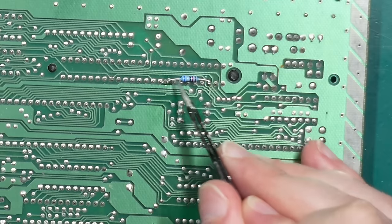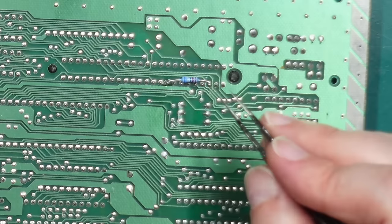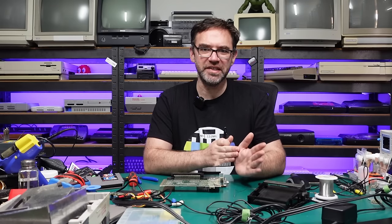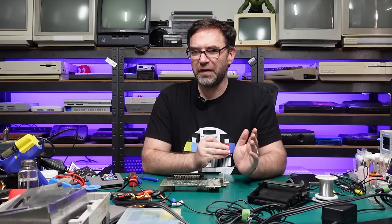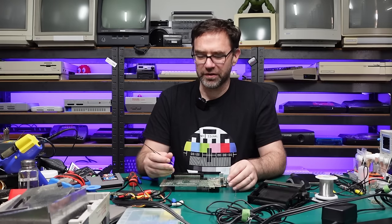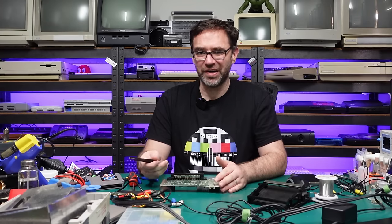I've just tacked that in quick and dirty — as long as those legs aren't touching the pins in between you'll be fine. There's one more recommendation I've seen: put a resistor between pin 3 and ground to get rid of any potential noise from the expansion audio mod. I tried a couple of different resistor values and found that the difference in noise level is about 2 dB, but when you're talking about minus 60 dB and minus 58 dB there's not much of a difference, so I'm going to leave that resistor out. If you choose to put one in, I found best results with a 3.9k resistor — some guides recommend down to 1k but I found that affects the actual expansion audio itself. I found 3.9k to be the sweet spot between reducing noise and leaving the expansion audio untouched.